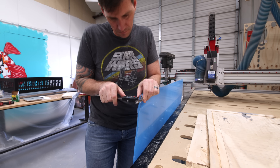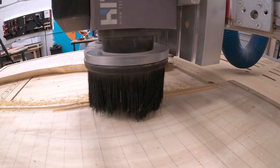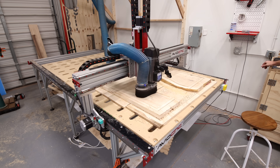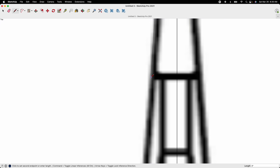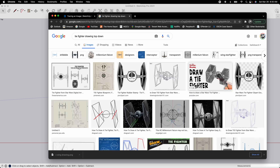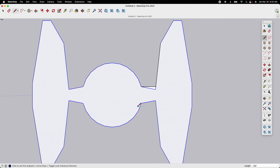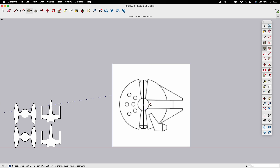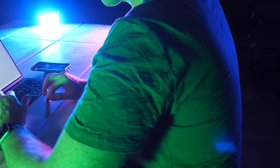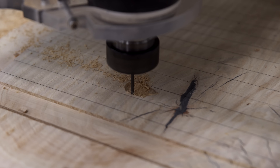In order to 3D model the shape of the live edges, I measured out a grid of lines on top of the slabs and measured every one along every inch to get the distance from the outside of the slab to the inside of the live edge. Then I jump into SketchUp and transfer all that information into a model to connect the endpoints and get a close representation of the live edge shape. I pulled it into Vectric Aspire to clean up line segments and create a more organic curving shape. For the three bowtie inlays — all different Star Wars ships — starting with an X-Wing, I pulled an online image into SketchUp and drew simple vectors around it. I did the same for a TIE fighter — I think I'll have to call it a bowtie fighter. Last, for a more traditional-looking bowtie, I drew vectors for a Millennium Falcon, copied, rotated, and mirrored it, then sent all files to the CNC to carve them into the slabs.